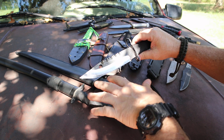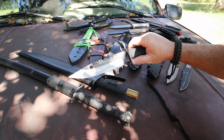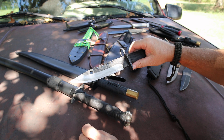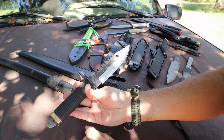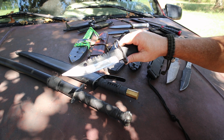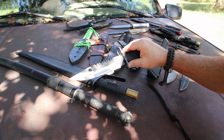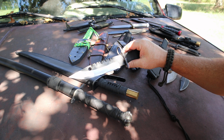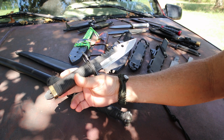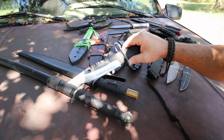This prototype initially had a hollow grind, but I've changed it up. I'm going to show you my Snow-Tac 7.5, but I'm going to move toward this newer model, which will have a really aggressive hollow grind down to a quarter-inch secondary cutting edge — hollow ground right through here — increasing the lethality of the cutting ability. This combat knife has a seven-and-a-half-inch blade. The serrations are designed to cut through small branches, one to two inches wide. So this is primarily a combat knife, with survival as secondary.